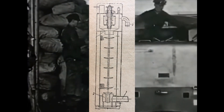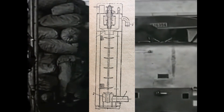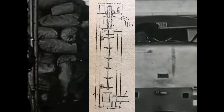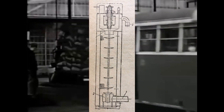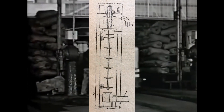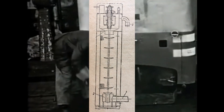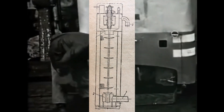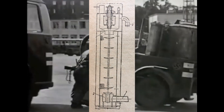The gas is fed through tube 1 so that it does not meet with the dust falling from the discs from above and does not carry it upstream. The dust falls into the sink — shown in the middle of the picture — and the gases pass along the circumference, shown by number 2. The gases come out sticking to the walls and not passing through the middle. There is a hatch at the bottom of the filter where dust can accumulate for 15–20 hours, and it is cleaned by opening the cover.